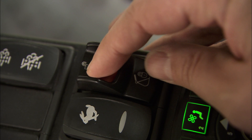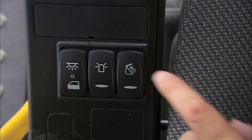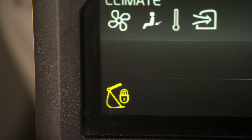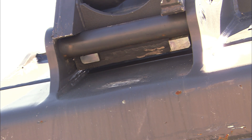Press the quick fit switch on the right-hand console in the cab, and then press and hold the quick fit switch on the left-hand console to operate the hydraulic cylinder. This pulls out the locking wedge in the attachment hook or opens the wedge under the pin.